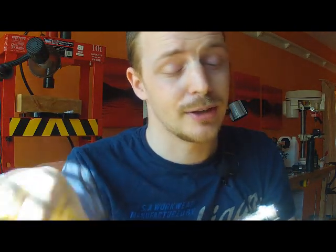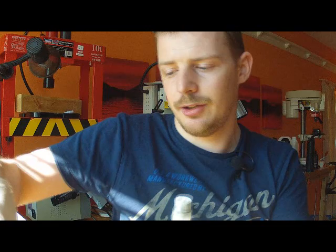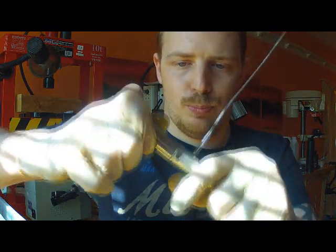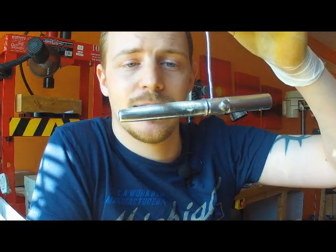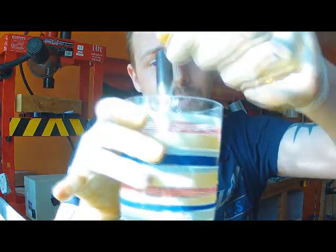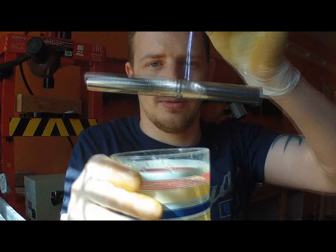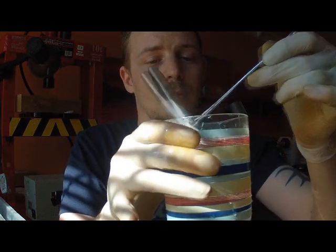An hour is plenty of time to get a decent finish of anodizing providing you've got your current right. Let's get the parts mounted onto this and get them in the anodizing tank. The lid can also push onto the jig. We have one jig, fully assembled with all the pieces of the pen we're going to be anodizing. I can see some residue from the latex gloves — that won't affect anodizing but will contaminate the tank. So I'm going to give them a quick dip in water to wash off any residue. Cleanliness is key with anodizing.